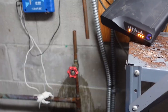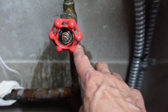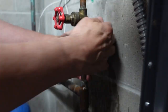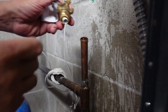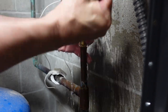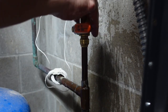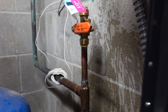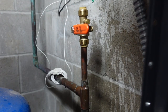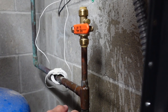So I'm going to try and do that now. The first thing I did is shut off the water main entirely and I'm going to cut this out. What I have here is a SharkBite connector, and I've had surprisingly good luck with SharkBite connectors on copper. So this is my fix for this particular issue.